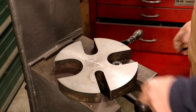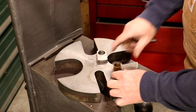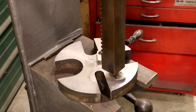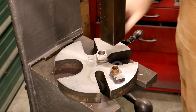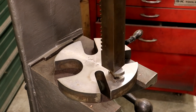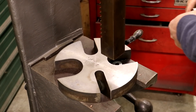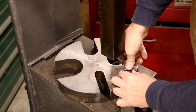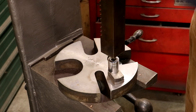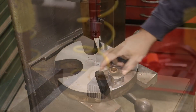We're going to go over to the arbor press and take that bronze bushing and press it right in there. It is a press fit, interference fit, probably about a thousandth oversize. We take the arbor press and press down on there, put that part in there. Once we get it into the bottom part, next we take and press the other part on top. Taking care to keep it aligned side to side and push that one down. The bushing is just a little bit wider than the two parts, so I took a socket that was a little bit larger diameter than that bushing, giving me good pressure all the way around, and we press it that last little bit home. It's a nice tight fit, it's not going anywhere.